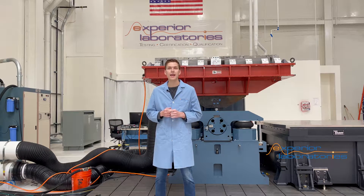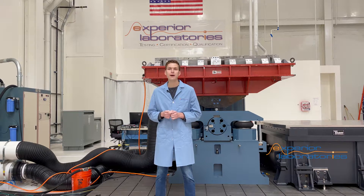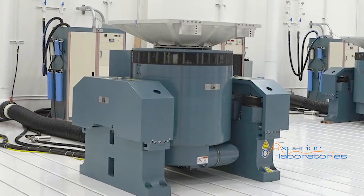For large parts, a head expander is commonly used to adapt from the armature and present a larger mounting area that can support the unit footprint, typically by tapering upwards in an inverted pyramid or cone shape.